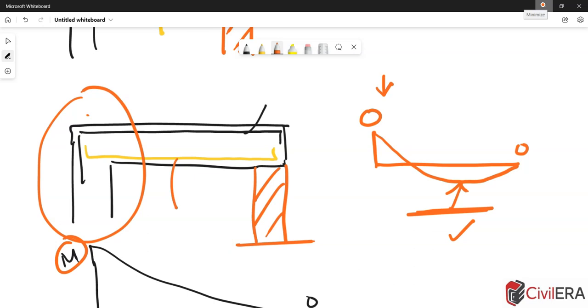When it's a small cantilever of around five feet and you already have adequate reinforcement, it may not matter. But if it's a very long cantilever and the bottom reinforcement is not available, that can create problems. I also want to say this is not only for a cantilever — in any structure, you need to appreciate what is changing when you introduce something new: what behavior comes into play, what changes. That is very important to make the final decision. That's all for now, thank you for watching.